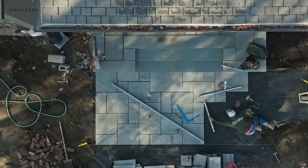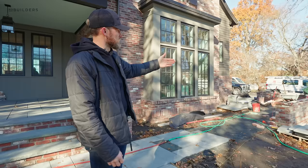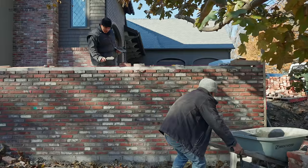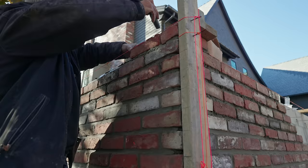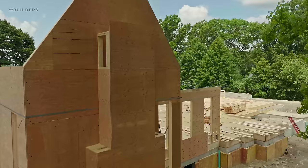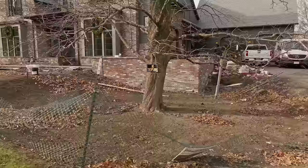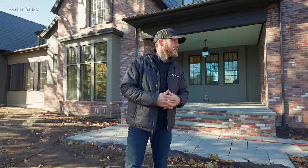Taking a few steps down, we have a couple columns to install, and they're installing the walkway that will bring you down to the driveway. With that, we needed this retaining wall — they've installed a retaining wall with the same brick to make sure the elevation where the trees are remains where it needs to be. When we demoed the house, we had a much lower elevation and these two trees were really important to save. We needed to make sure we did not bury any more of the tree root zone, so the earth is actually ramped up around it very intentionally. We had the arborist out to make sure we were doing it appropriately.